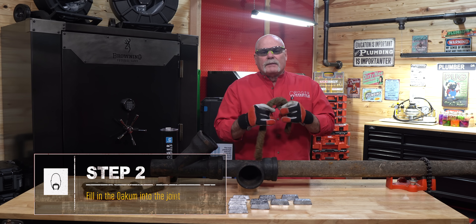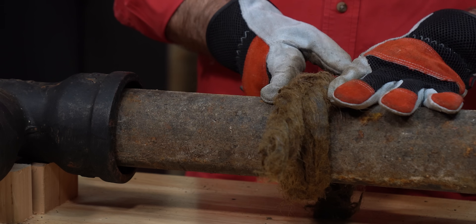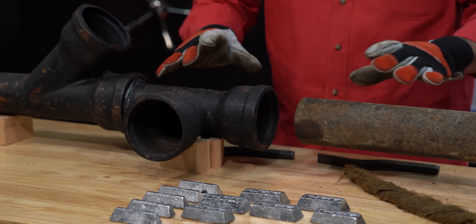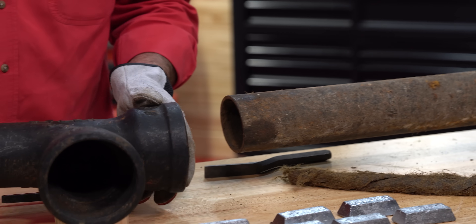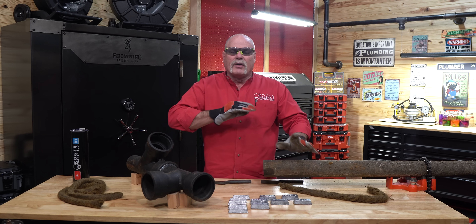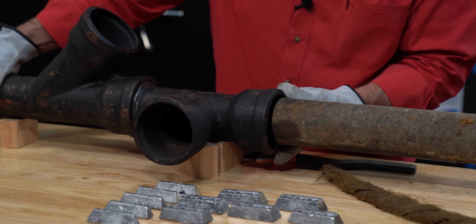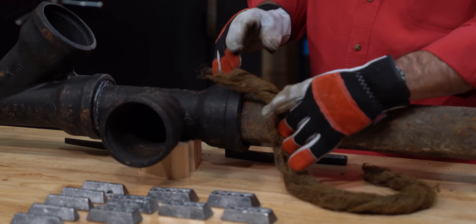If you remember from the last video, I told you — you want to pack your oakum down to where you leave about an inch for the lead. So if you look how wide this is, it's going to go two joints around and give me a couple of inches, which is going to come out just about right. I've got a couple of irons here. We've got a little jig built where we can slide this back and forth. The pipe is not cut perfectly straight, but that's probably the way it would be in the field. If you look down inside the fitting, it's got a spot where that pipe sets in and beds in — that's so you'll have good laminar flow through there. This is a piece of pipe we literally cut out of a joint in the field, and this is the way it had been installed, so we're going to go ahead and use it. We've got some thick oakum too.